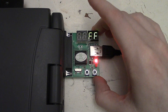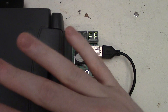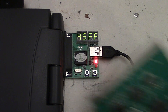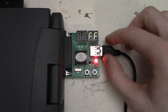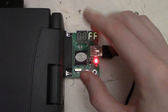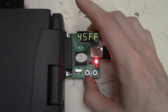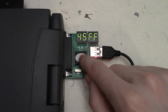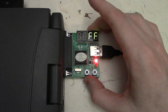It's pretty simple to use. The two big takeaways: first, this is generally going to be for laptops - not all desktops will support outputting BIOS data on the data pins of the parallel port. Second, because it uses 5-volt power off the USB, you generally need a small 5-volt power bank or adapter, or power it from the laptop's USB port. Keep in mind that some laptops, when loading the operating system, will reset the USB, cycling the power and losing the memory on the test card - so generally stop the laptop before it tries to load the OS.